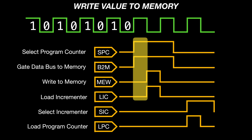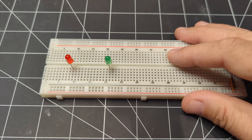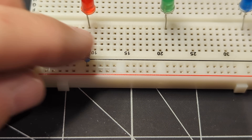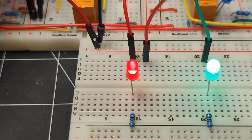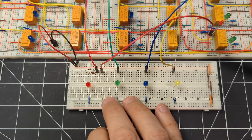There is a one-step delay between the first two control line activations and the second two, which is needed because relays need some time to activate and settle between operations. I'll flash up a link to another video I did on relay timing in more detail. Back to the job at hand, we just need to create these four pulses and use some diode logic to keep these pulses high for multiple clock cycles. I'll set up another breadboard with an LED to represent each of the new pulses, then wire in the appropriate steps from the sequencer, add some trusty diodes, and give it a whirl to confirm the pulses are all hunky-dory.